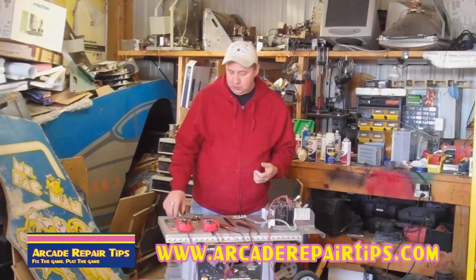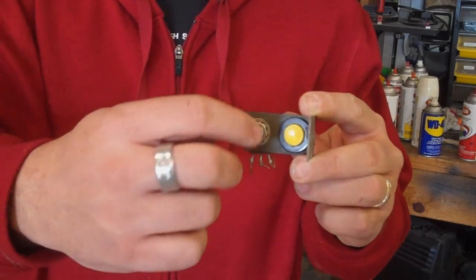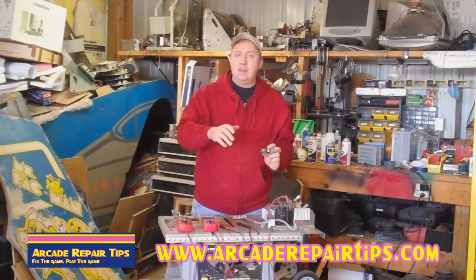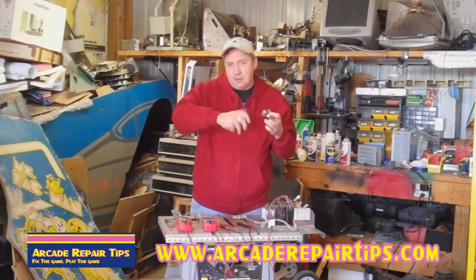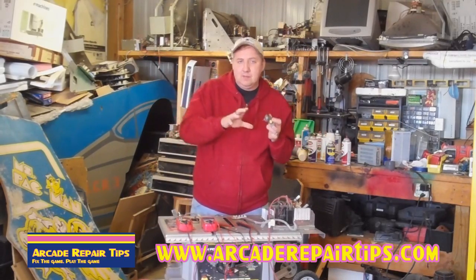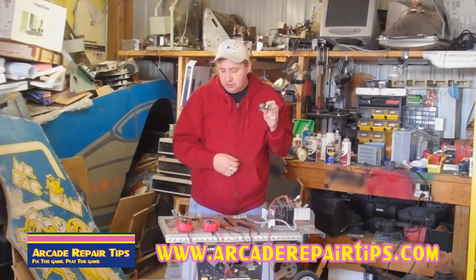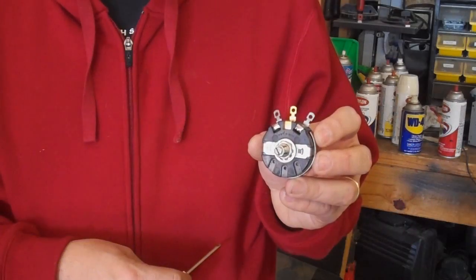So we are going to look at a few types. There is the type I just mentioned that is more for volume. Here is one out of a game that is near a test or start button — you would reach up inside and turn it by hand. As you add more resistance the volume goes down, but as you turn it up or let the resistance through, the volume goes up. It is kind of like a valve when you open and close it. There is also this type which is a bit bigger.